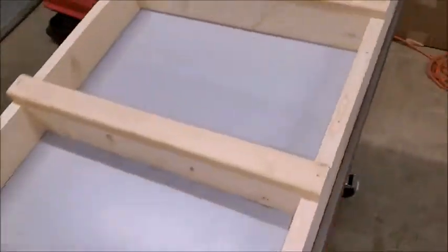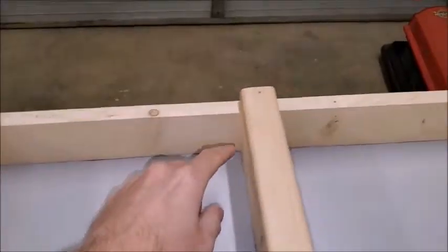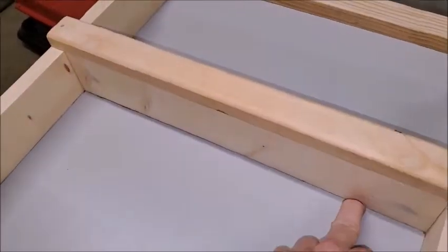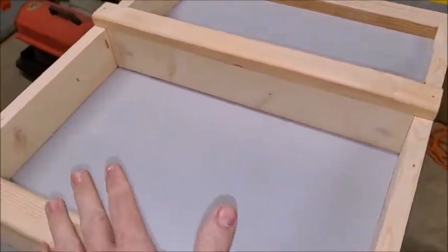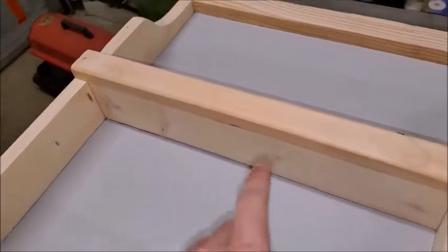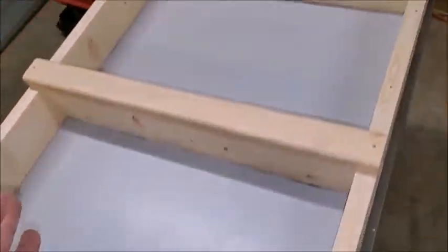Quick update. This is the product after 2 coats of that gray. Before you remove the tape, run a razor blade across the edge of the seam here and then peel off the tape. Otherwise, you risk peeling up and you don't end up with as crisp of an edge. Mine aren't the best, but it could have been worse if I didn't run that razor blade across there.